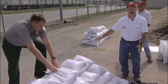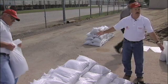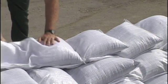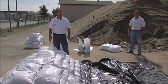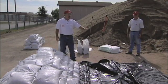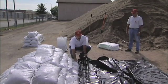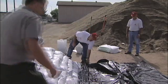The width of the levee gives us a much longer seepage path, because any levee will seep — it doesn't matter if it's a dam, an earthen levee, a plywood levee, or a sandbag levee. Water is going to get through it. So we want to get the sandbags down on the bare ground in a good cross section. For extra protection against seepage, we recommend putting plastic over every sandbag levee ever constructed. You lay the plastic down first, then put your first row of sandbags on the water side on top of the plastic to anchor it, then pull the plastic up over the top.